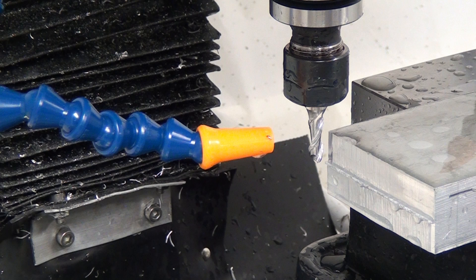This is a quarter inch end mill with a 3/8 shank. It's got a 5/8 flute length, it's two flutes, it's high speed steel. Interestingly, it's got a 42 degree helix angle, which is kind of high for high speed steel — you usually don't see helix angles like this except for carbide.